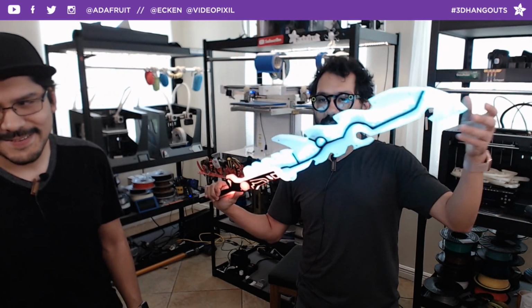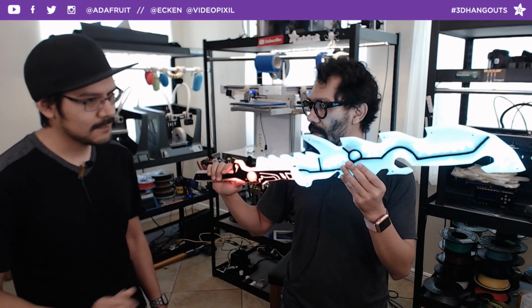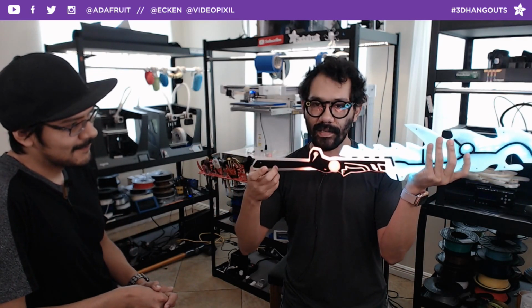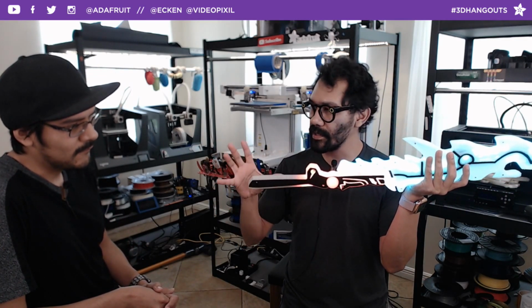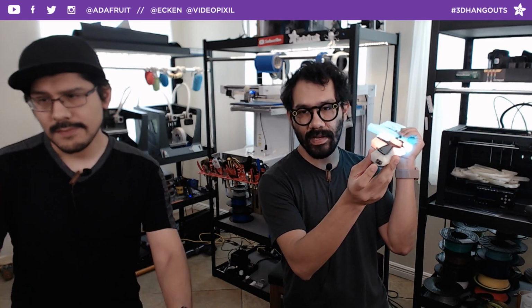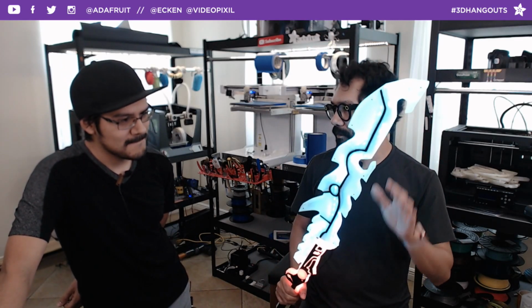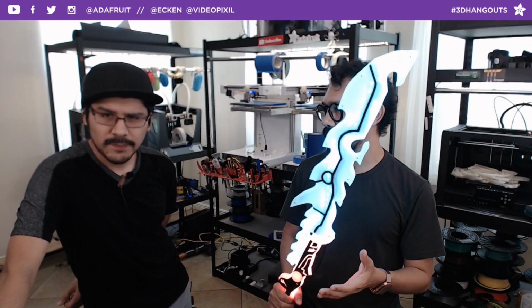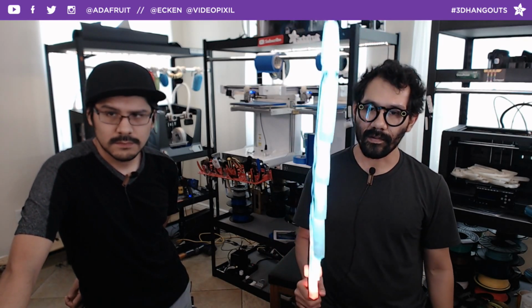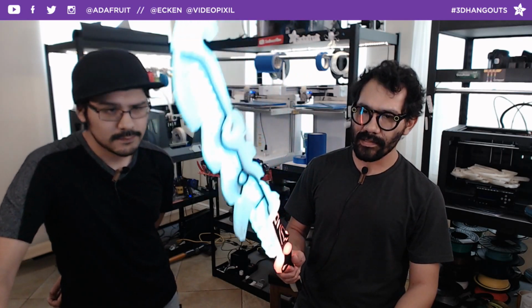It is 34 inches or 860 millimeters big. It's 6 pieces held together with M2 screws, and we have a Trinket on the inside with a LiPo backpack to handle the recharging. We have a 2200 milliamp hour cylindrical battery on the inside. We have ports you can easily reprogram or charge this nice big bad boy, and then you have the mini skinny Neopixels inside here. This is what's actually making all of the projects come to life, because before, when we had the bigger, wider Neopixels, it was a lot harder to make something nice and slim like this. It's only 12 to 15 millimeters thick, and it's about 2 pounds, so it has some heft to it.